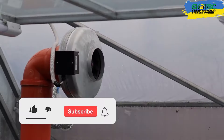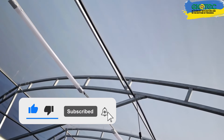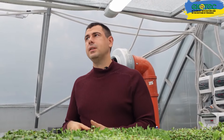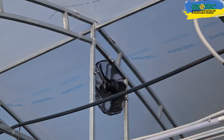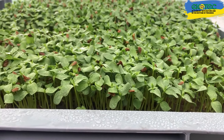What's also good is that at night we create air movement, and we have less humidity. As you can see, our greenhouse is actually quite dry. But due to the temperature difference — it's warm in the greenhouse and cold outside — dew forms on the walls. There are always droplets there, and due to air movement caused by the fans and heat accumulators, we reduce the humidity in the greenhouse and prevent droplets from accumulating on the dome, which can then fall onto the plants.